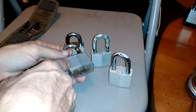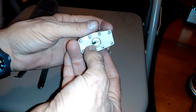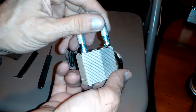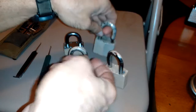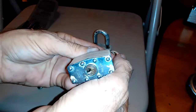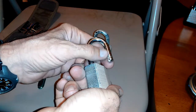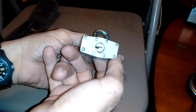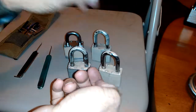Some of them I cleaned up a little bit. The bottom I didn't take the rust off or anything — I just made sure the cores were done because they were painted over. This one I tried to free up but I don't think I got the core to turn. This one I left as-is just to show you what happens when people paint locks — the paint dries and acts kind of like super glue. Here's another one I cleaned up. These locks are, I believe, five pin — I can feel five of them clicking in there. It's only a single locking pawl. It's 44 millimeter Chinese. They were probably all keyed alike because they're all made the same, and the power company probably put them on there.